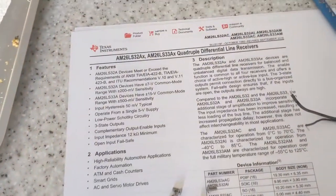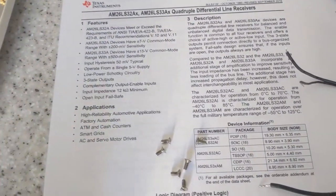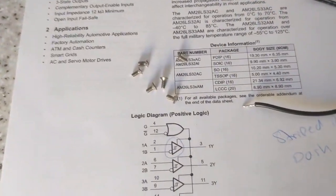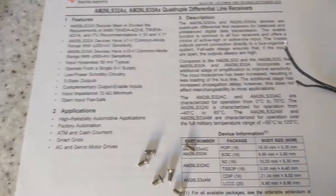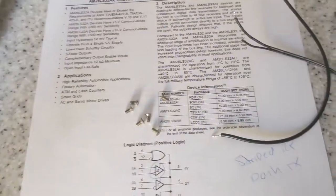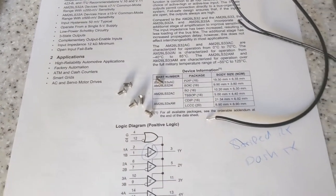Now, I have actually tried to reverse engineer it. It does have an RS422 port on it, but unfortunately there are no signals on it. I've connected the oscilloscope directly to the UART chip — there are still no signals on that either, so unfortunately I'm not able to get it to do anything. But I've done some EEPROM dumps as well, but I'll just show you what's inside it.